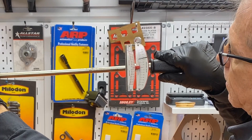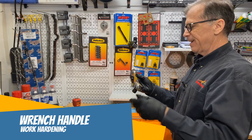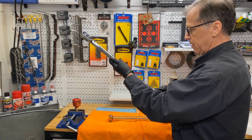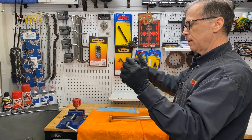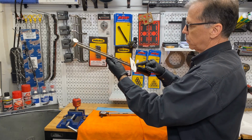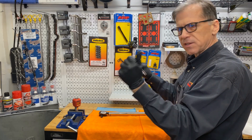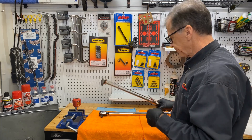It's easy to see zero looking straight on; it's harder and less accurate from an angle. Another thing that affects accuracy is how many times the beam has been bent, heat cycles, how many times you've over-torqued — because the beam is what bends and measures torque, so those factors affect calibration. Heat, cold, dropping, and work hardening all reduce accuracy. This beam-type wrench is about 30 years old and reads low on the higher scales, but it's still accurate at 20–30 foot-pounds, so I use it for that range. It's been work-hardened over the years and is no longer as accurate at higher values.